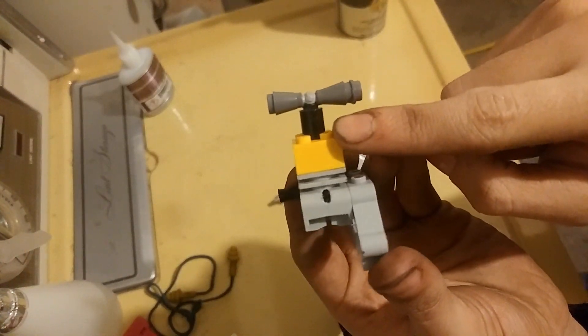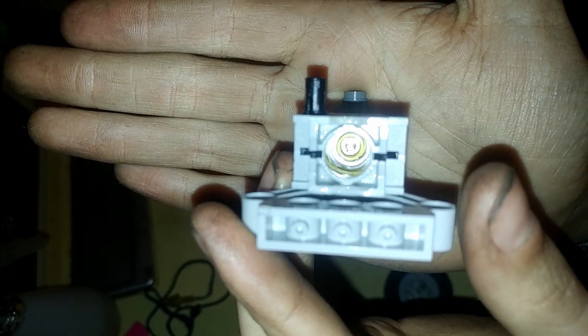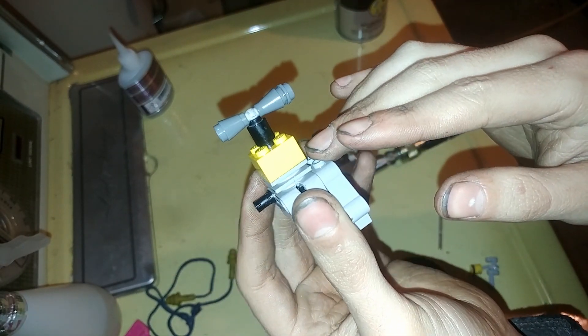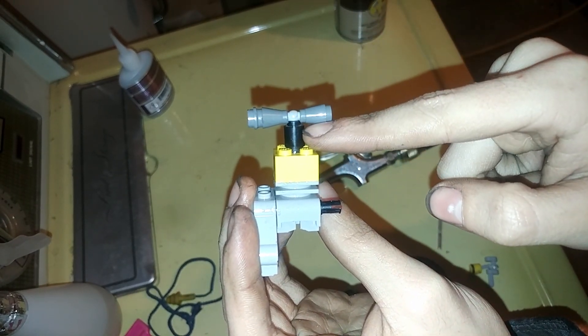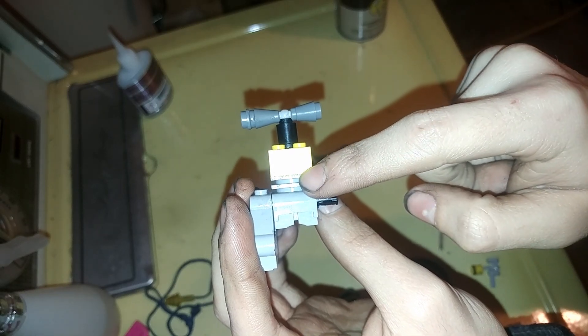This here is the most important part. Inside of it, at the very top, there is a tire valve from an automotive car tire. I have it set so that every time the piston comes up, it hits that tire valve, and incoming compressed air goes in through here and enters this black chamber where the top of the valve is, and then shoots into the — not combustion chamber — but the expansion chamber.